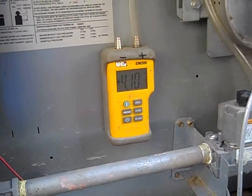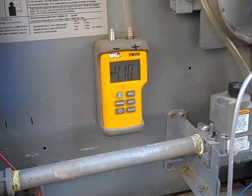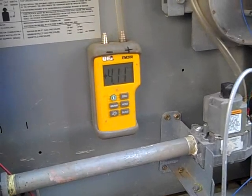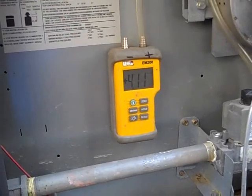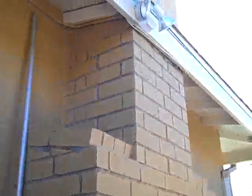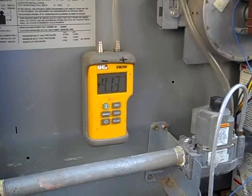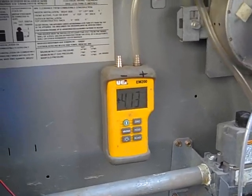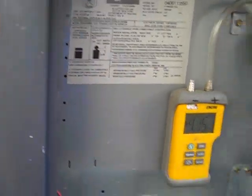There's also the chance that when you run other things in the house, it will take gas away from the heater and this pressure will drop. Currently it's summertime, probably 90 degrees, so I don't imagine the house is using much gas. But if the gas range were on, the hot water heater, if they have gas heat in the house, or even a gas fireplace — if you run all of those things, you don't have as much gas available to the heater, and then this number's going to drop below the minimum, and that's where we're going to be in trouble. That's why we want to put these two numbers back in the proper range: the 7 to 14 inches of water column.